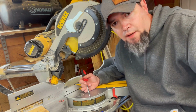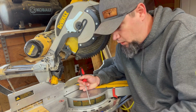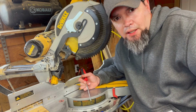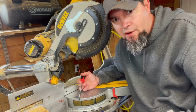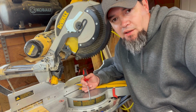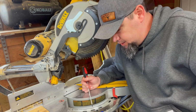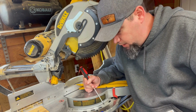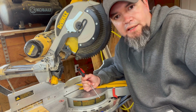But have you ever gone to make, let's say, a 20 degree cut? It's here on our miter gauge, and you cut it and you make another 20 degree, and they do not match up at all to make your intended miter. The reason why is because all of this miter gauge is set off of zero, where the 90 degree is.